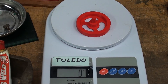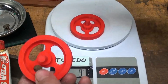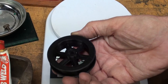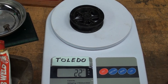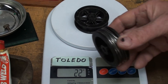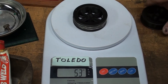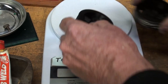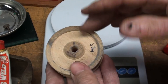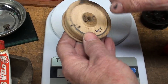The original flywheel weighs nine grams. The one printed 100% solid weighs 22 grams, so two of those would be about 44 grams. But with the lead — actually it's tin solder — wrapped around it, I'm up to 53 grams. Kevin's flywheel with the supports weighs about 33 grams. A lot of people drill holes and put bolts in to create weight, and you want most of the weight around the rim.